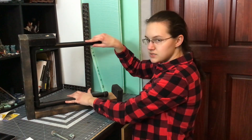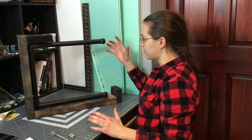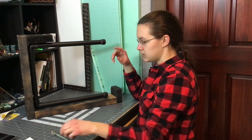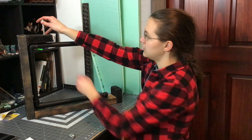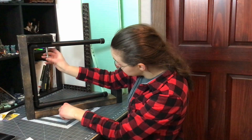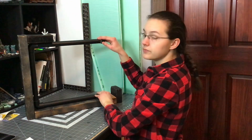You can loosen it and then tilt this a little bit, though that could cause issues with the table part. If I wanted to, I can easily take this off and use it just as a knife once I get the wiring in. I also have another hole through the top piece here, because as of right now this has a lot of flex. By adding a bolt through here, I can add a little bit of tension to keep it from flexing nearly as much.